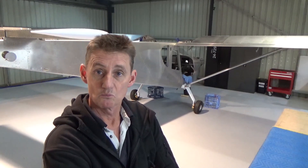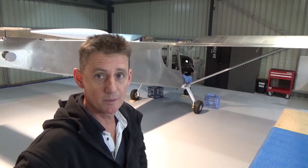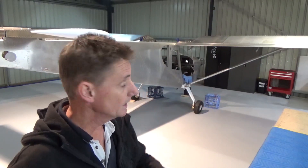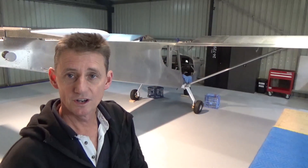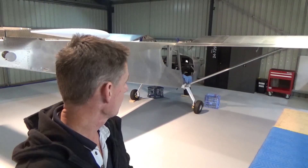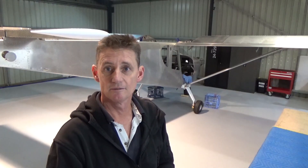So that's it for now. Wings gone on, really happy. The dihedral lining up with the tail plane just looks fantastic — I was really worried about that. Worked my way through it. Next video: start on the flight controls, put on the flapperons. I'm also going to have a play with the top skin, the sunroof, maybe get the doors on. I had a quick look — the door sill won't fit in there, I've got to trim the wing. Better to do that than have a nice painted aeroplane and have to get out the Dremel. So a bit of pain there, but I'll slide the wings back, trim it, put them back on again. Thanks for watching, hope you enjoyed that one, see you in the next one. Bye.